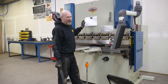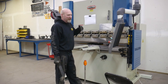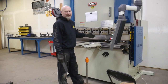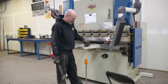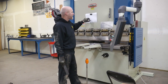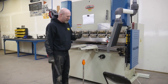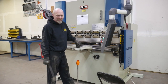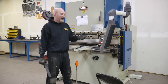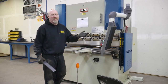One thing we learned when we got the press brake is that we had to figure out — if we want to bend something to 30 degrees, what Y dimension is that? What we did is take a bunch of small sample pieces, made a lot of bends at differing dimensions, and basically plotted it out on a chart. That gets us close, and because those samples are only about an inch wide it'll be a little bit off, but it gets us close enough to dial it in.